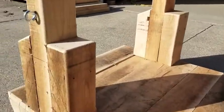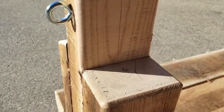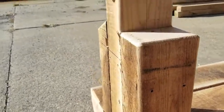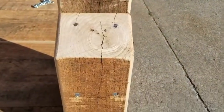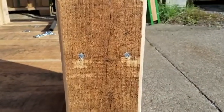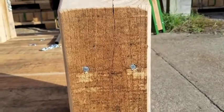On the back, we do basically the same thing. This block is toenailed at the top with two spikes and gets nailed through there. At the top, you toenail in with two six-inch spikes, and there you run two six-inch spikes through there as well.